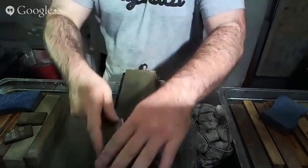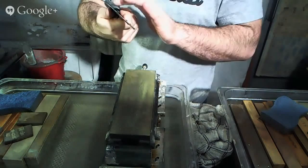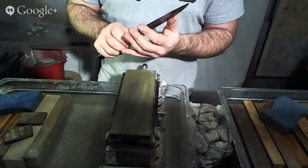And we can check and see, do we have a residual burr here? What's going on? We can look closely at the edge and see what it looks like and what kind of feedback that's going to give me. Did I do a good job? Do I see faceted bevels? Do I see areas that don't look like they've been sharpened? Do I see a glint of light at the edge, which would be indicative of me having still a wire edge or a burr? We can also test on our thumbnail and do that light pulling motion to see, does it dig in? Is it sharp? Does it have the kind of edge feel that we want? Some people like to use a three-finger test, and that's totally fine too.